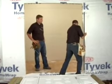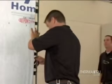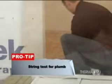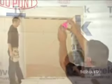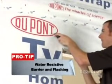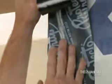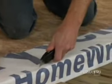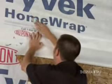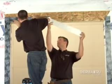Check to be sure framing and walls are plumb using a six-foot level on both sides of the opening both ways. Also, check that the wall surfaces around the opening are in the same plane by performing a string test: attach string diagonally across the opening from the outside — the string should gently touch. If it does not, the opening is out of plumb by twice that distance and needs to be corrected. Flip the string over itself to check both planes. We also recommend the use of a water-resistive barrier applied to the exterior sheathing, and adhesive or flexible flashing to seal it. The barrier should be cut in the opening following manufacturer's instructions, with the head flap taped up to be sealed later in step 11. Flashing material should be applied in an overlapping manner, always working from the bottom up.